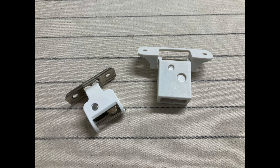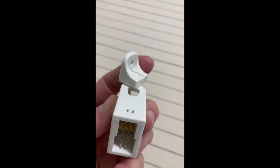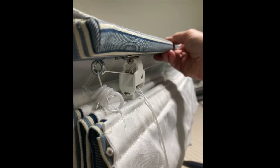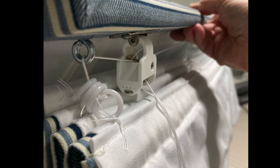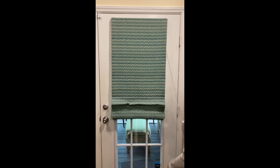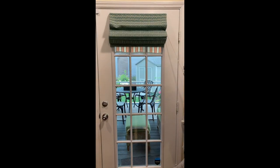The next thing you might not know about these cord locks is that there is an inside and an outside. The wire is fed through the housing, and on one end it looks like the top of a staple, and on the other end where the wires poke through, it looks like the pointy ends of a staple. Whether you put your cord lock on the right side or the left side of your mounting board, the staple-top side — the more finished-looking side — should always face the outside of your shade. This ensures that your tension lock and release work correctly, and it'll also look neater if someone sees the side of your tension lock from the room.